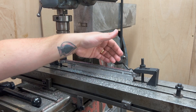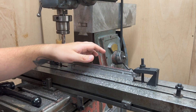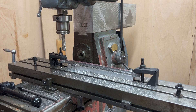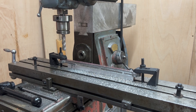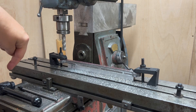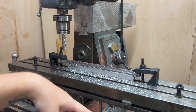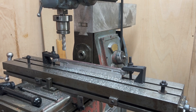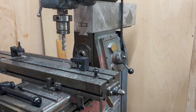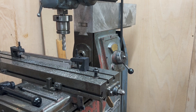On the back end, I did one side, did half of the other, realised there was a problem, and did loads of small cuts just going down — not trying to do the full depth. All of those things together meant it's just a bit laborious. Thankfully, because this is a horizontal machine, having unlocked the handle and the quick traverse, I can now move this way back to where we started, come across slowly, quick traverse it back, and so on.